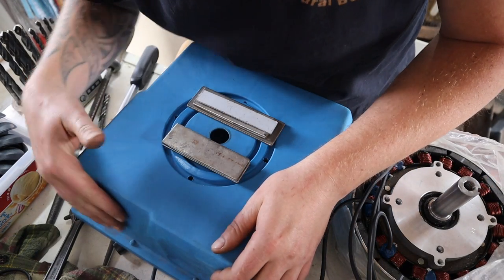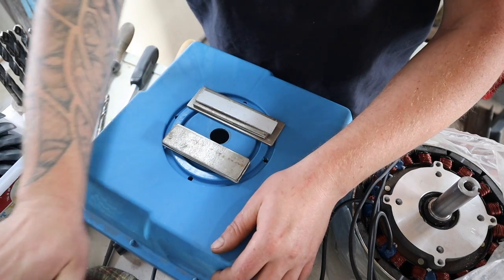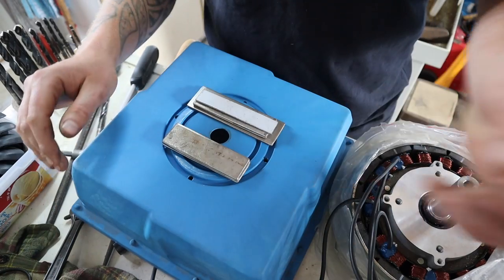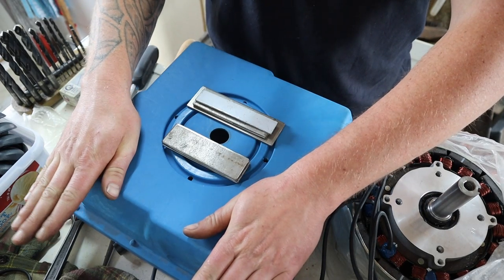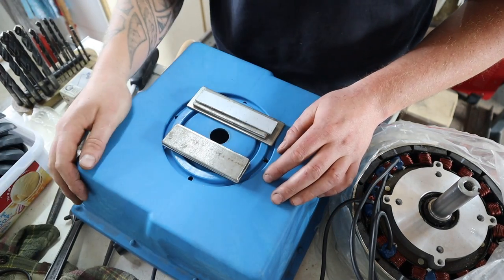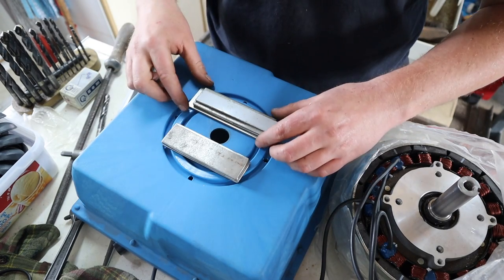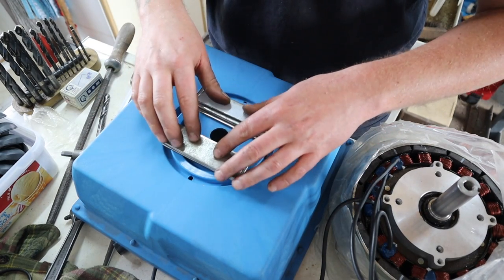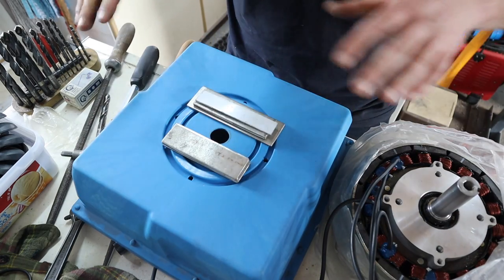On the sides here there's going to be nozzles with quite some weight pulling them either way, so I want a plate out of here to support everything and mount my mechanical control system to. That plate is going to be 10mm thick, so I'm just spacing everything out with these 10mm spacers for now, clamping it all together. I can make this part later but everything will be fixed in the right place.